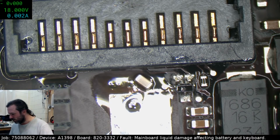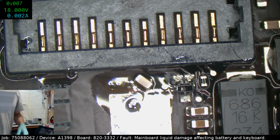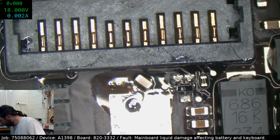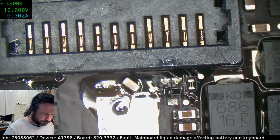402.1, 25 volt. So 25 volts, obviously the key part here, because we're dealing with a battery that can get to about 12 volts maybe. Hundred nanofarad, 25 volt, 402. We'll get this one down first and then we'll put the 100 nanofarad in.